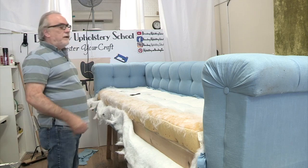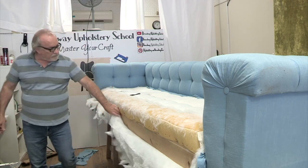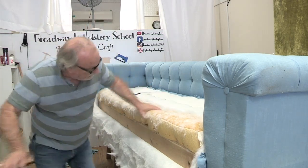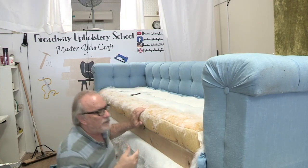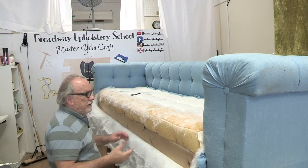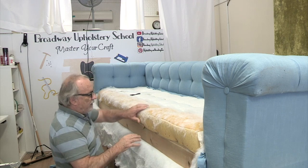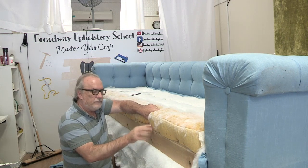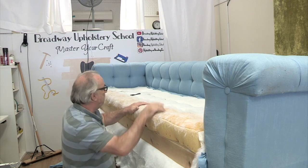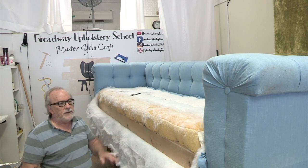I'm sorry for all the manufacturers watching this, but this would have been a real problem in a couple of years — maybe very shortly, actually, because it's starting to fail. This is just foam; that's all they have in here. It's webbing and foam, but what I want to show you is they simply just stapled the foam to the wood in the front. The foam is failing around the staples, so this is moving. What happens is it exposes this sharp edge — really sharp, like a knife in your sofa along the whole front edge. Very shortly you would have had a rip right on the front. If you've seen sofas and chairs with rips right on the front, that's because it wasn't done right.